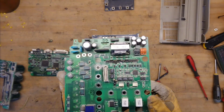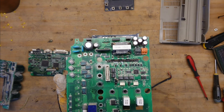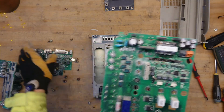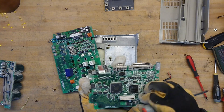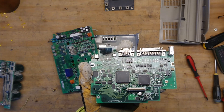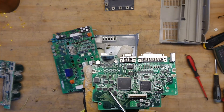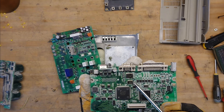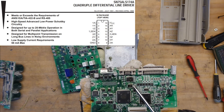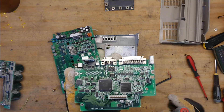Going back to the control circuit — this is the gate drive circuit controlled by a 90602 microcontroller with its associated logic all around it. This is all only to do with driving the brick underneath, since all the logic for inputs sits up here. Here we have a 223 C620F101 microcontroller with what I would guess is a little serial controller sitting next to it, along with a lot of decoupling and input protection. We can see that the thing that let the smoke out was a 75ALS174 — so that seems just like a regular logic input circuit that burned, which would connect to the personal computer or digital operator, which was not connected.